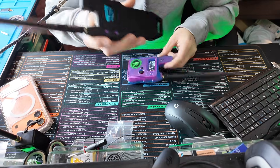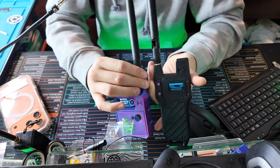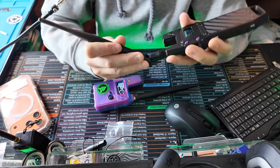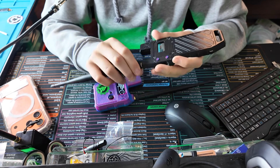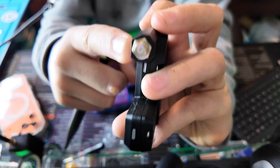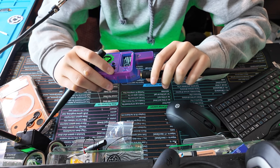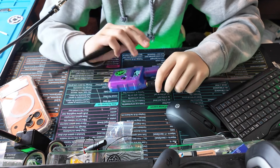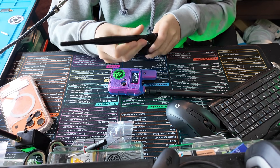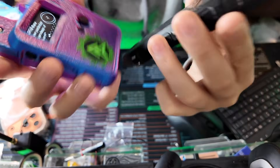I feel like it's pretty easy. One positive I do have with the N39 is that both of these antennas I put on here myself — I'll leave a link in the description if you want to upgrade your antennas. Luckily, the N39 came with a female SMA antenna, because the ones here in the U.S. are male antennas. As we went over yesterday, the N37 has a male SMA, which really screws everything up. So you don't really have to change anything — you just need a nice 915 MHz antenna and you'll get some crazy awesome range. Also, this one has a white display and this one has the blue.